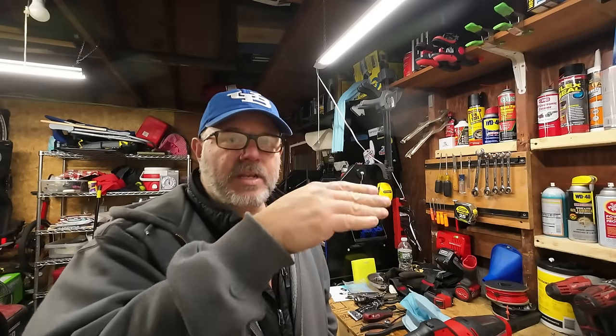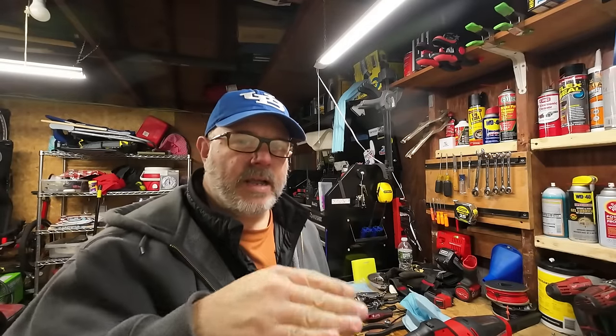So I think my exhaust is what caused that problem. I had the exhaust that comes down. I showed you where it goes through the wall. It comes out of the heater, dips down a little bit, and then goes up and out of the wall. So I think that might be the problem. Tomorrow we're going to raise that heater up and mount it on the wall, and the exhaust is going to go right from the heater, straight down, and then directly outside.